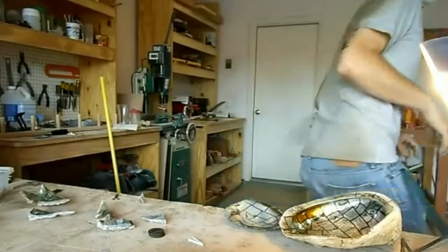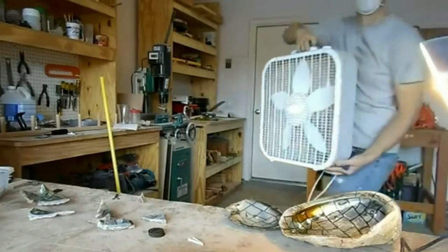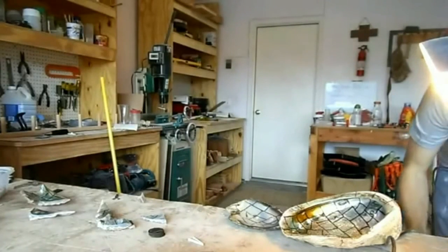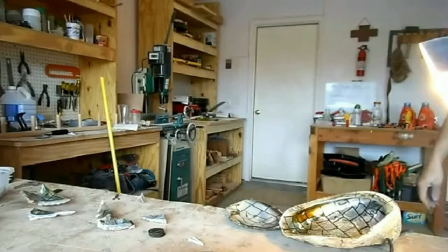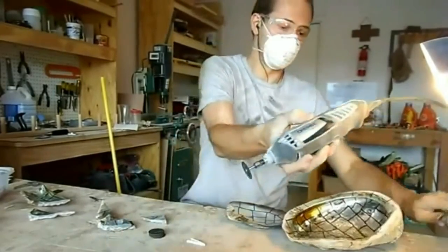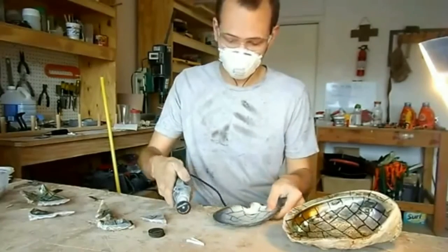That's what this is all about — making precise cuts to precise thicknesses of inlays. Because if an inlay is too thin, you'll be able to see through it, light will be able to go through it; and if it's too thick, you'll have a hard time cutting through it and you'll go through jeweler saw blades pretty quickly. So thickness is a pretty major part of it. Also another good idea is to have a fan to blow the dust from your work area away and really just keep it clean. Okay, let's begin.